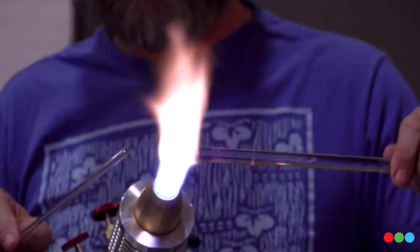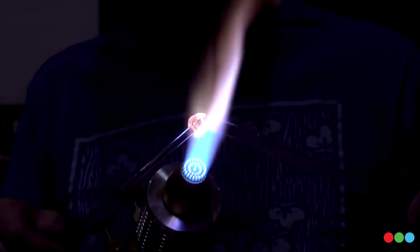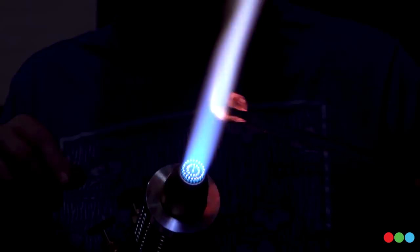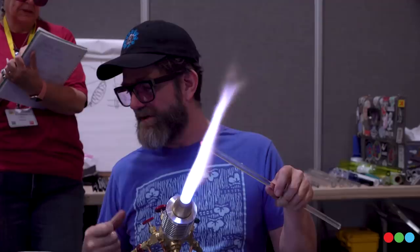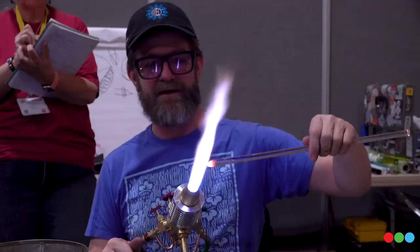I want this to be still kind of dull at the end — this was a pretty nasty break off the rod. Today we're focusing on technique, but you can notice if your rod's a little dirty. When you get to the shop in the morning, get some Windex or whatever and clean off your rods. Some of that stuff on the surface will just vaporize and not be a factor, but some of it will boil in and leave bubbles.